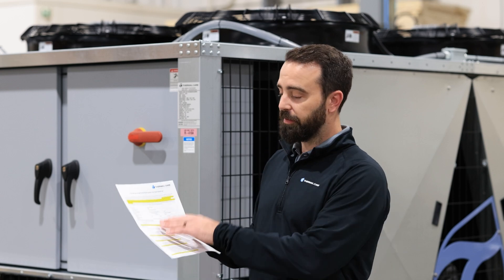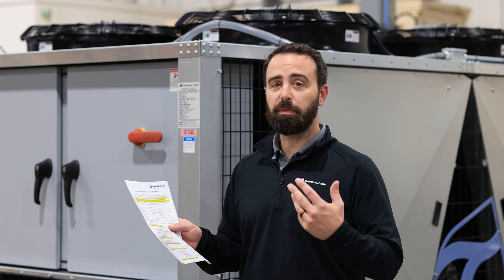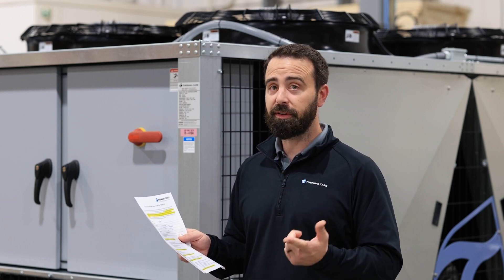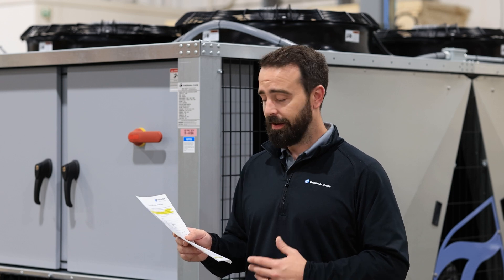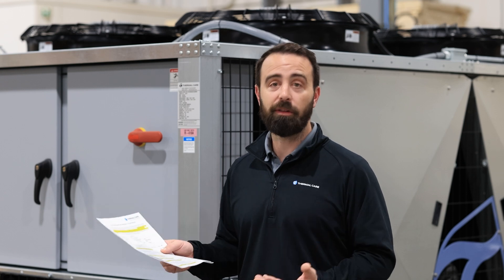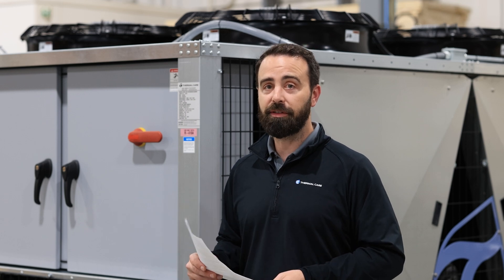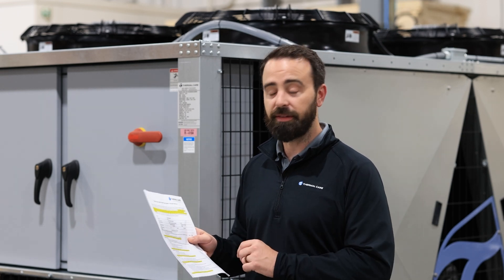The rest of this front page, each of these sections shows an area that would apply to almost all systems. It includes your piping — to have your piping installed, pressure tested, leak tested — to ensure that your pumps are rotating the right way, ensure that any strainers are clean, and that the system can actually run with the load. Then we have variable frequency drives. This section may not apply if you do not have any drives in your system, but this ensures that they are powered and ready to go when we're there to start the system.